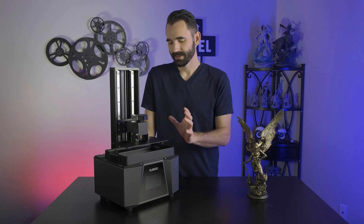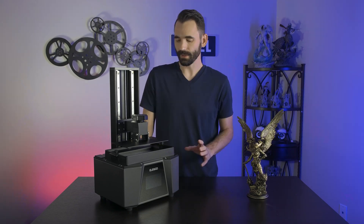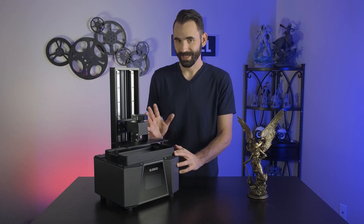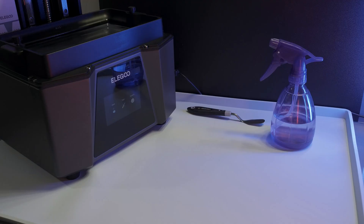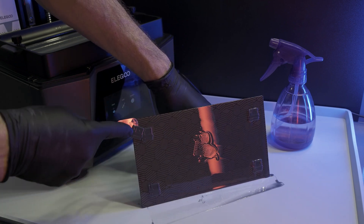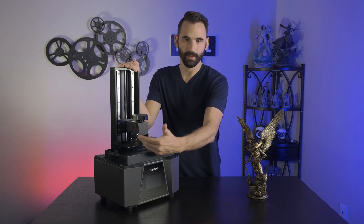The ball joints are harder to level. They move out of level a little bit faster — I've tested this on a micro scale. They do actually rotate a little bit during the print, especially if you have more prints on one side or the other, which can cause layer lines. The one thing about this 4-post design that's a little less than perfect is how low it is. I found it incredibly difficult to level, and going into the forums, a lot of people had the exact same issue. Some said this printer was absolute garbage — until I showed them the workaround, at which point it pretty much started printing beautifully for everybody. I have a build plate calibration part that will allow you to test your level and set the Z offset. If you do that on this printer, it's going to print beautifully, but if you don't, you're going to struggle — you'll have prints that either don't start or fall off the build plate.